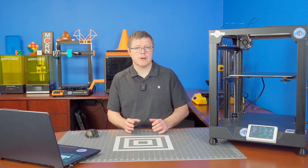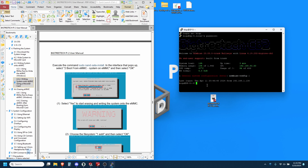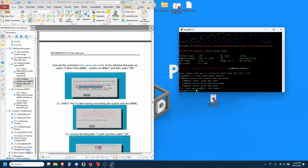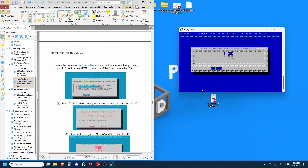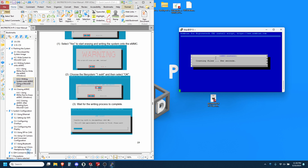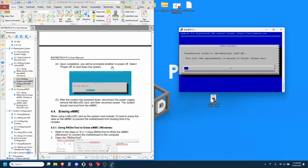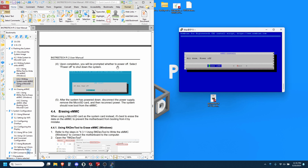One thing I really was curious about is the eMMC built-in storage. The instruction manual provides two different methods for installing onto the eMMC. I went for what I feel is the more simple option, doing it from an SD card. It was as simple as SSH-ing into the Pi with something like PuTTY, which is what I use, installing the SD card, running a few commands and scripts, and you're good to go. The nice thing is the instructions have pictures — screenshots of what you will see as you go through the process. That's a nice touch and really gives clarity to the whole process and makes it easier for newcomers.